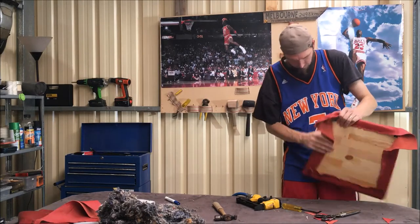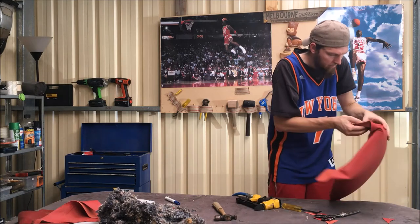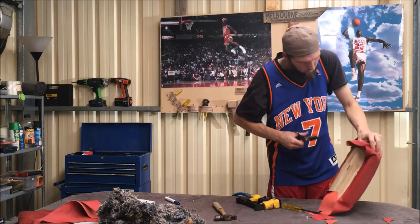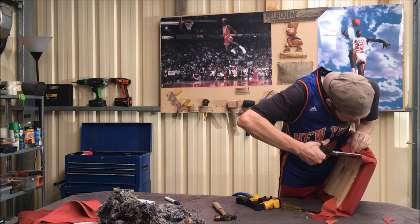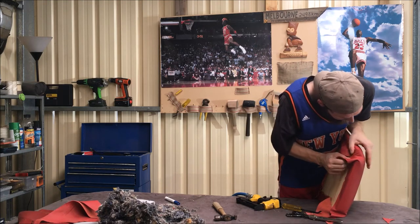The back of this seat is a bit more tricky because of the cutout in the wood, so firstly we cut to the center of the corner and then pull on both sides and staple off. Be careful that your material doesn't tear at this point. After that's done, we cut out the excess and fold over the edges again without having creases over the edge.